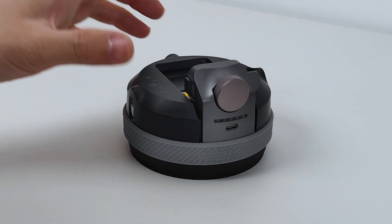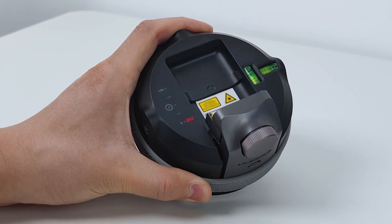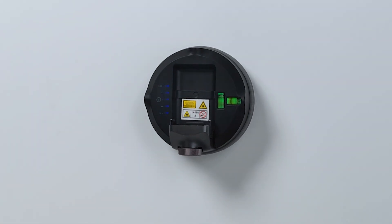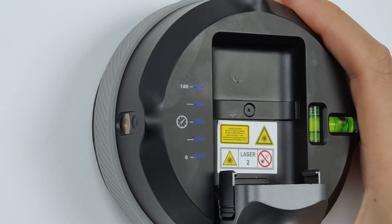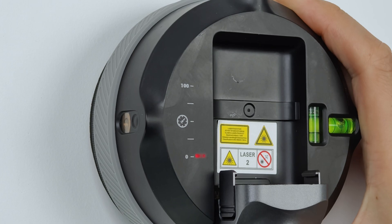Vacuum Control. When the device is not attached, press and hold for 2 seconds. The white LEDs will light up one by one in sequence from 1 to 5, and at the same time the suction starts working. When it's attached, press and hold for 2 seconds, then the LEDs will turn off in the opposite order from 5 to 1 — and that's when it releases.